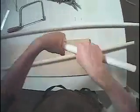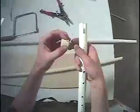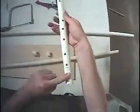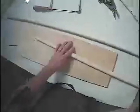We've got the short piece of PVC that acts as a kind of lock to the rest of the system, this piece of wood that's kind of like a cork, and the PVC pipe with a notch and holes. In this version, we're going to use 3/4 inch PVC thin wall. This is 1/16 inch wall, and a piece of 7/8 inch dowel rod.